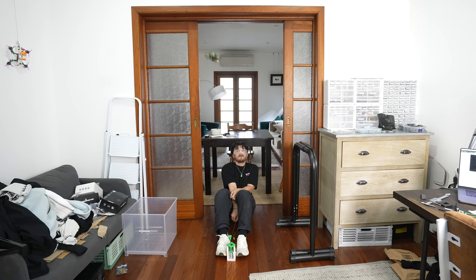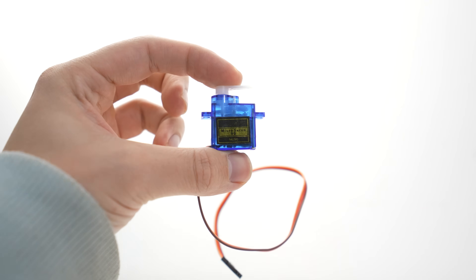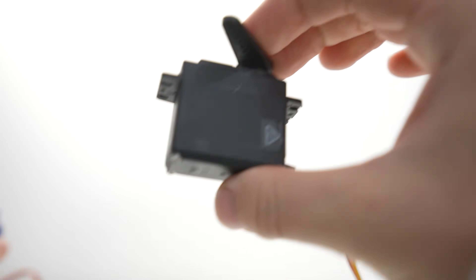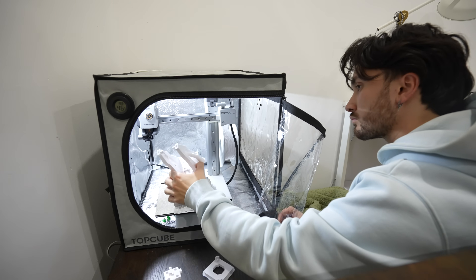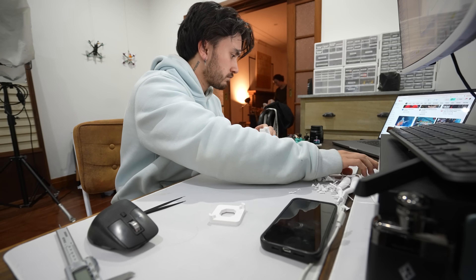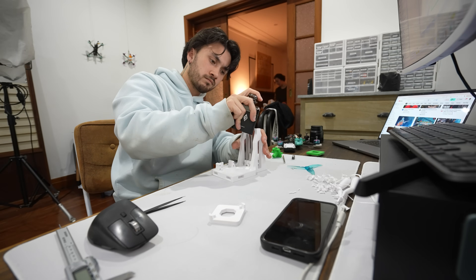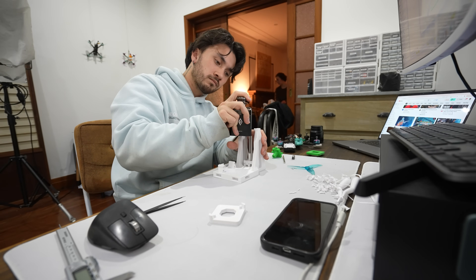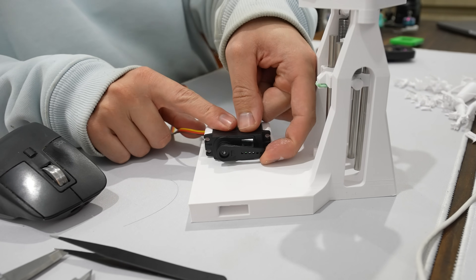The good news is that we had the height. The bad news is it was taking a lot more force to pull out the pin than I originally expected, so we're going to have to swap out the tiny servo with a more beefy one. I remodeled the design to fit this beefy servo, and somewhere between the previous prototype and this one, we lost the hammer. Anyway, the servo isn't functional yet, so we're going to shift our attention to the Arduino and the latch.